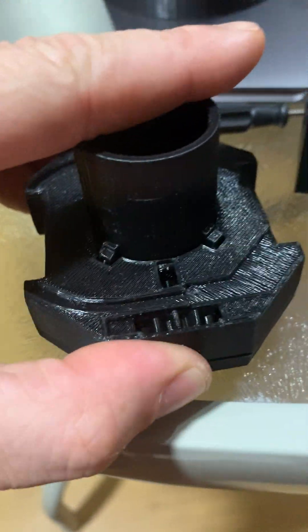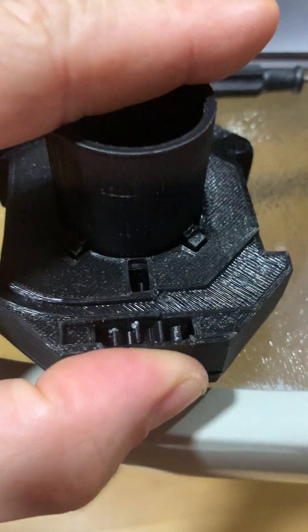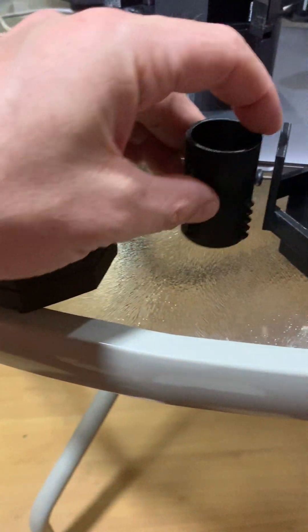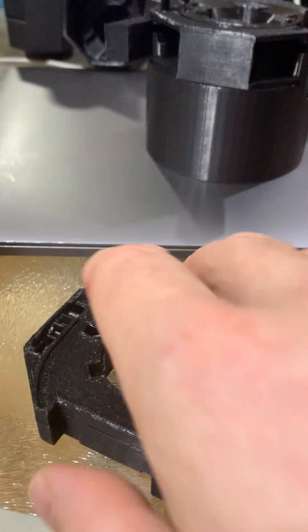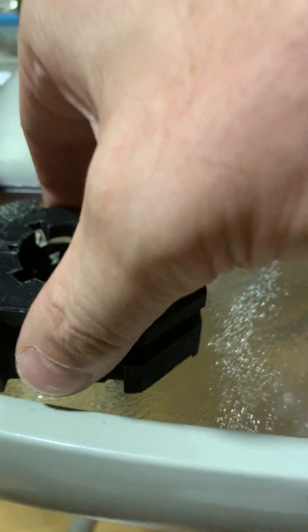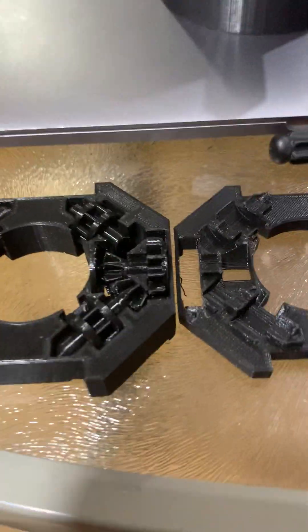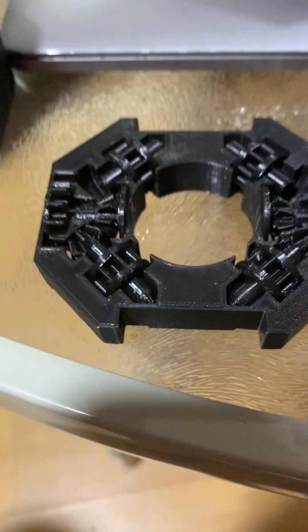Maybe I need to play around with the tolerances between the angle gears, make them even bigger. But I've gotten rid of as much friction as I can in the system. In this four-piece design with these extra slider gears it actually works quite well. With 0.2 tolerances as opposed to 0.8 — effectively 0.1 in one dimension — it's working out quite well.